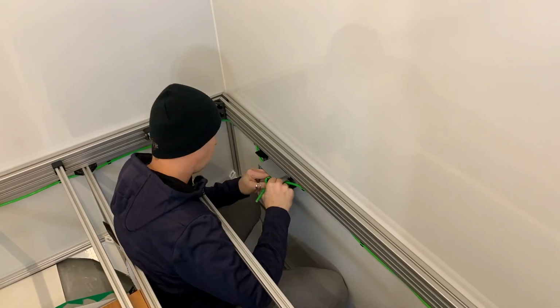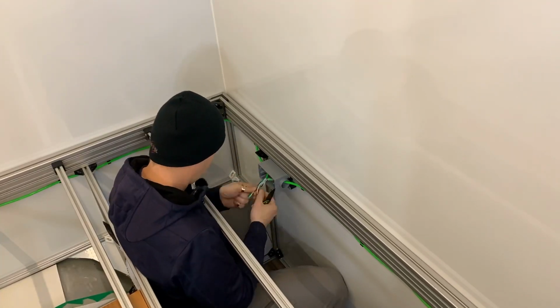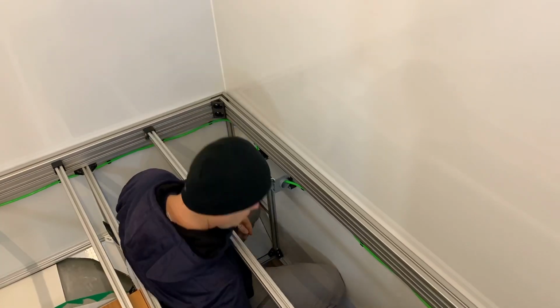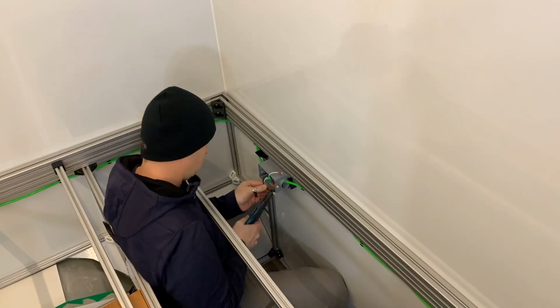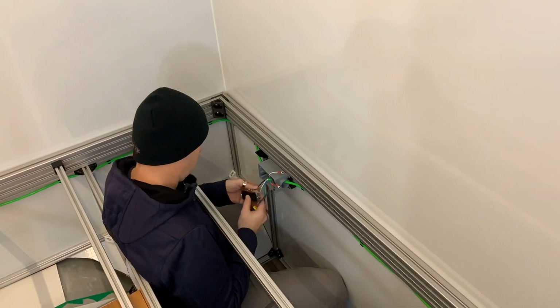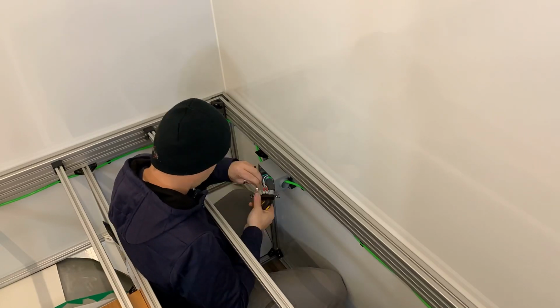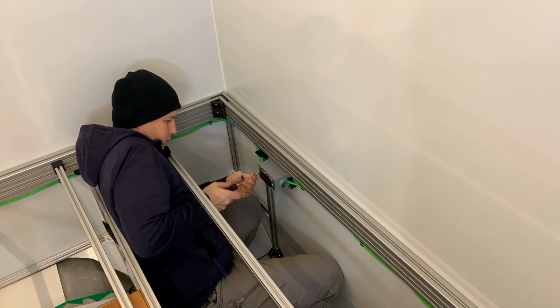The only thing I'm doing differently at this outlet is connecting the second wire set to the second set of screws on the outlet so we can continue the circuit. Even though I'm using weather-tight boxes, you've surely noticed that I'm not using liquid-tight strain reliefs, and you may be wondering why I would wire up an outlet without them. Don't worry, it will make sense later.